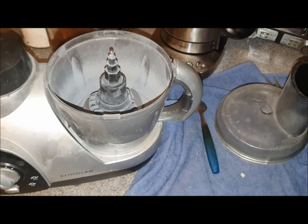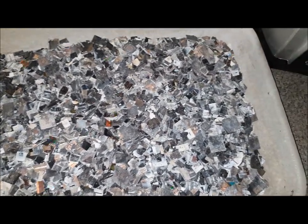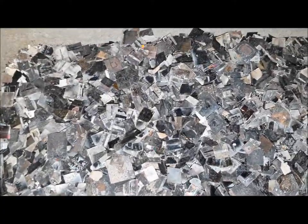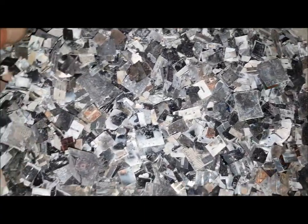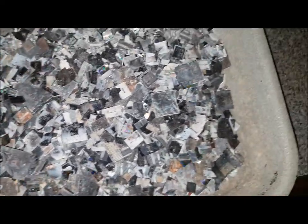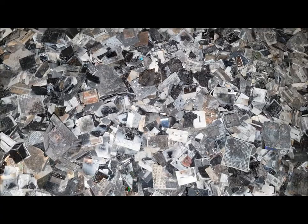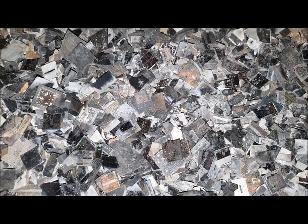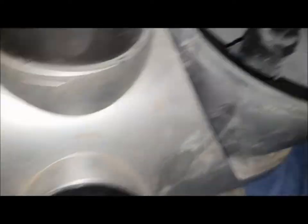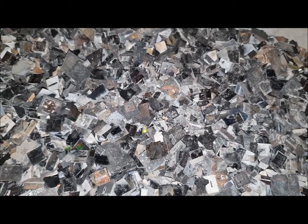So I've got the blender out — I was using it for the gold corner BGAs — and I'm going to make use of it being out and do my RAM BGAs now. You can see there's a lot of glass, a lot of circuit dies, so I'm not going to get a whole lot broken down but I'll do the best I can and get as much broken up into a powder as possible. There's a fair bit here, so I'll do some small loads, probably half a barrel at a time. I'm not going to go through the whole sieving thing — you've seen it in the IC chip video. Basically just going to put it in, blend it, sieve it, get some more, put it in, blend it, sieve it. Whatever doesn't go through the sieve will go through the blender again and again until I'm sure I've got everything.